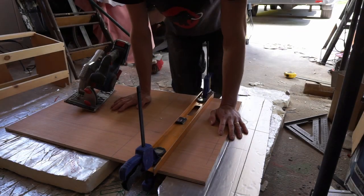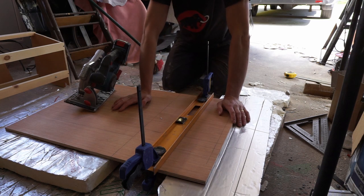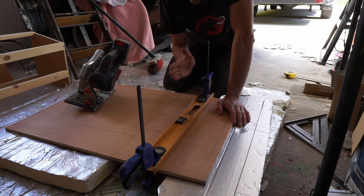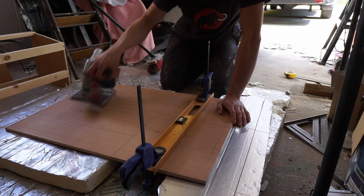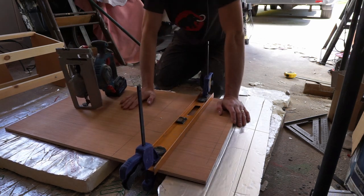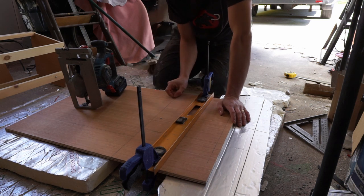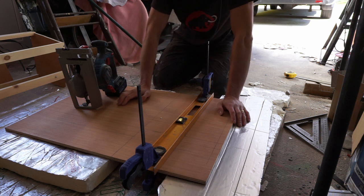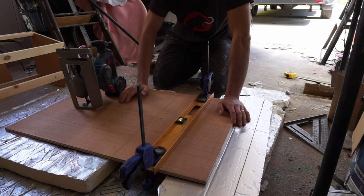Right, so you're cutting some of the panels from the cabinets. This may be very basic to a lot of you, but definitely new learning for me. So when you cut, and to make sure that what you measure is exactly what you cut, you need to take into account the thickness of the blade. So whichever side you're keeping, you want to make sure that the thickness of the blade sits far side of the line that you draw, otherwise you're always going to be 2 or 3mm out, which just will not work if you're making exact pieces for cabinets.